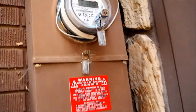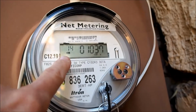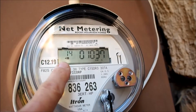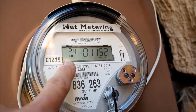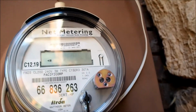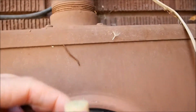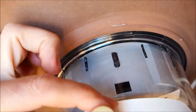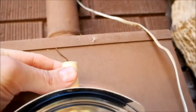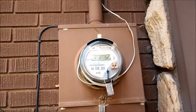So this is one of the more modern energy meters. It's been out for 5 or so years. Instead of a dial, you have these LCDs, and you can see the frequency of that blinking square tells us what the rate of energy usage is. In addition to that blinking square at the top here, they have an LED. You can't see it there, it's infrared, but this little clamp-on sensor can see it, and it just monitors how fast that LED is blinking. And if you follow that wire up, we'll go into the garage and we'll see where that data goes.